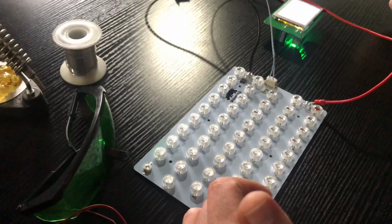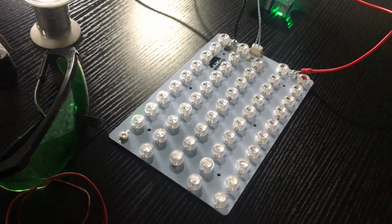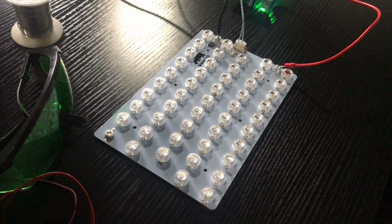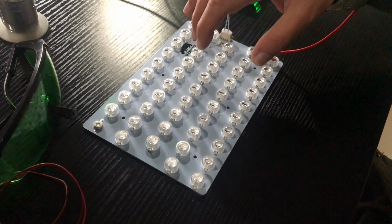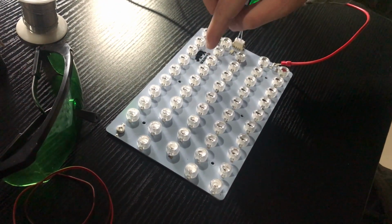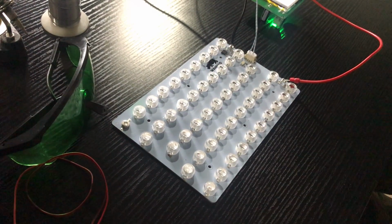First I'm going to explain why this issue appears. Sometimes on your Duplicator 8 you see that a part of the board or LEDs doesn't power on, or doesn't light up. This doesn't mean the board is defective. As you can see, only a part of the LED lamps doesn't function. The reason is there are a few batches connected together in a circuit, and if one of them goes off, that circuit is shorted, and it causes the part of the board or the lamps connected together not to function as well.